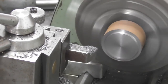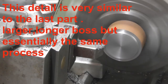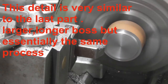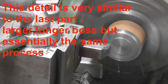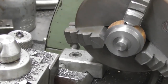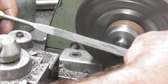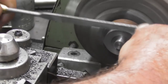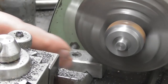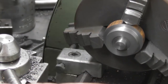So I've put the piece of bar stock back up and spaced it with zero set. I need a shoulder on here to leave a boss in the center of three-eighths diameter and I need to come back three-sixteenths — that's 0.1875. Roughing it down. One point one two five — we're there. I've made a decision not to put the holes in at this stage — I'm going to do that later on the mill.